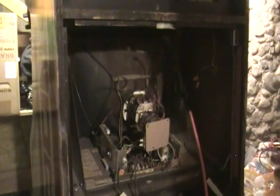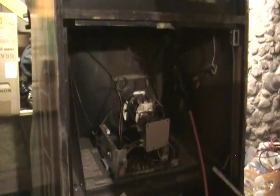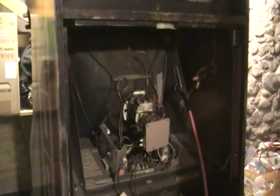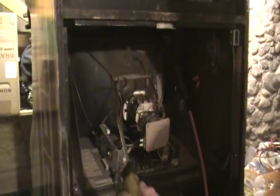I connected the other end of the wire with a similar setup to the chassis of the monitor. Now I'm going to stick my hand in my pocket as suggested, get up underneath this cap, and hopefully discharge this monitor without sending myself across the room. The whole reason for doing this is I need to get the monitor off to recap the monitor board, hopefully to fix some horizontal width issues and other issues with the system. So here we go — wish me luck.